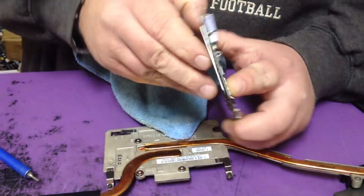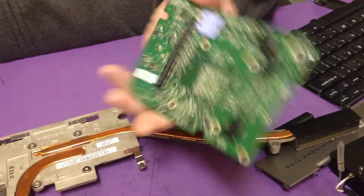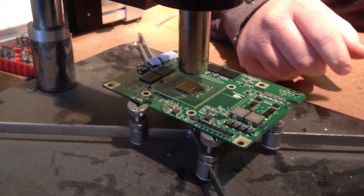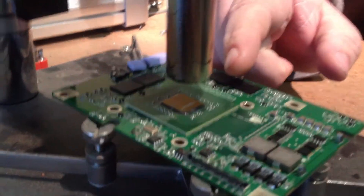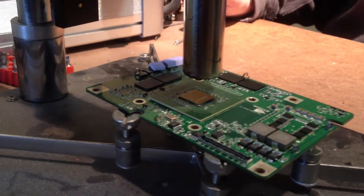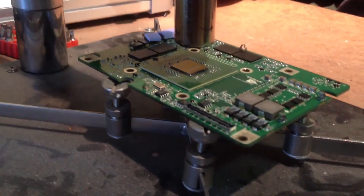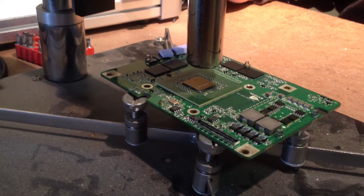This little plate comes off the bottom. Have it like that before you heat it up. Once you get the goop cleaned off of that, take the sticker off of it, heat it up, turn on your reflow machine. I started out at 100 degrees and then gradually bumped the temperature up to 360 degrees.